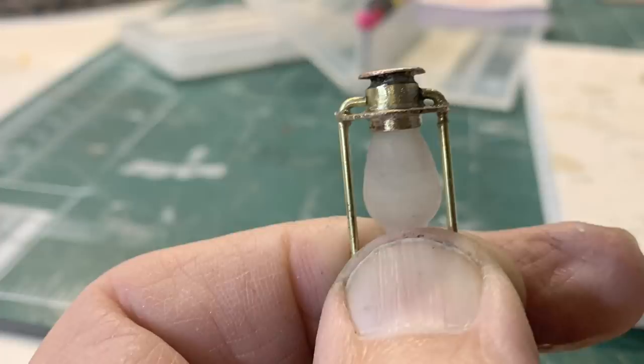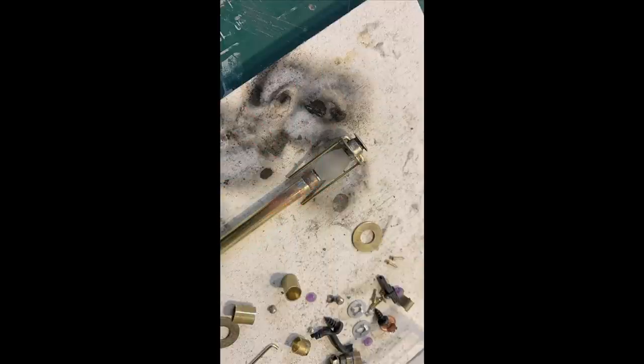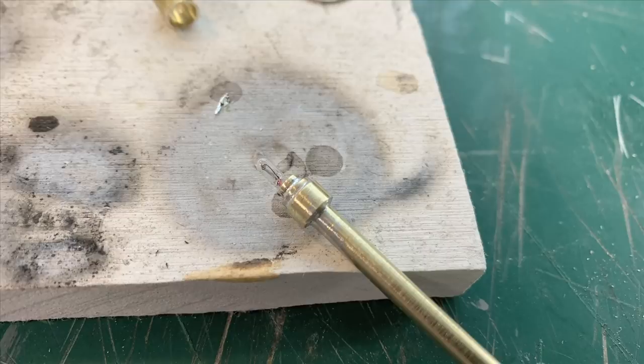It does. So it's time to move on to the font, the bottom part of the lantern. And the Dietz Pioneer font is really good sized because it has to be able to burn all night. It's a street lantern, after all. And then the gas return tubes actually return to the very bottom of the font. Oh, really? Which is unique for a Dietz lantern of any kind. But that's a very unique feature on the Pioneer.